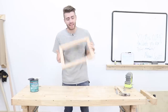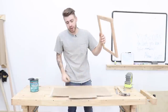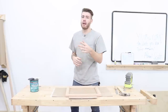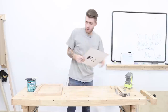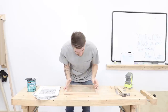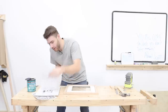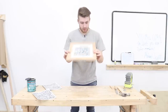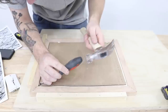Our finish is cured and our print is ready. The last thing we need to do is make the little backer board. You can use eighth-inch plywood or sixteenth-inch plywood, but I — like most people in America — have a lot of cardboard from Amazon packages, and the cool thing is it's basically free. I traced the opening of the frame, then used a razor blade to cut about a half-inch outside of that so it fits right into the groove. Step one: glass. Step two: get your mat in with hopefully clean hands. Step three: artwork. Finally, put your backer board in. Give it a quick double check to make sure everything looks right. These pins are called glazier points — they hold the backer board in and are easy to remove if you need to switch out the artwork.